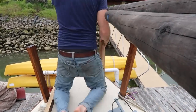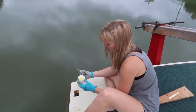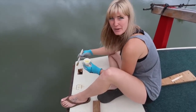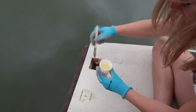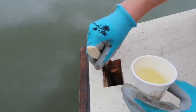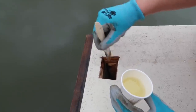The cramped part was almost over. We still have to fasten them in, but after cleaning up the edges and making sure the angle of the hole was right for caulking, Garrett got a break while Ruth finished up step one: saturating everything with epoxy to seal up all the end grain of the plywood where the stanchions go through the deck. That way, if we ever get little leaks in the future, the plywood won't wick it up — every little thing to prevent rot.